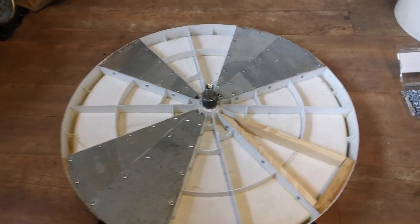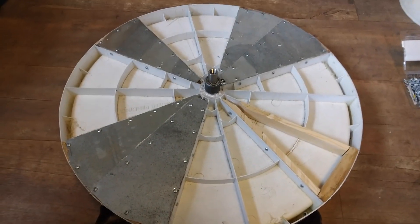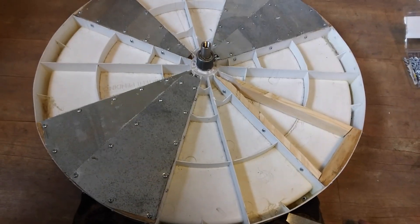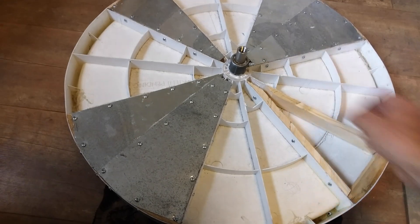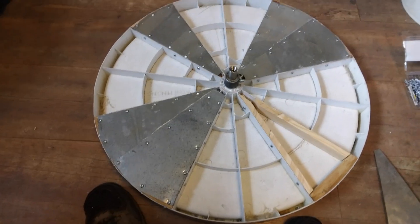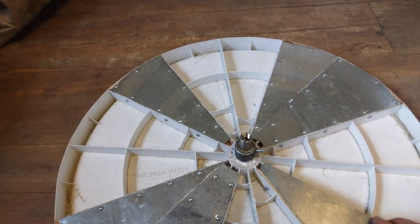The secondary part of this turbine where the blades are — what I'm going to use here is just part of the structure of this Lazy Susan shelf. I knocked out some of this webbing and put some wood framing, then I'm covering it up with some pieces of sheet metal to make some channels for the water to flow to the center of the axle, or it'll be expelled. On the nozzle chamber side, I got some holes drilled in the outer rim where the water will exit to get into these other channels. Probably would have been easier with a big two-foot pizza pan, but all I had was some pieces of roof flashing.